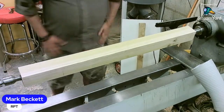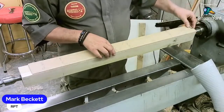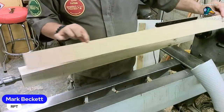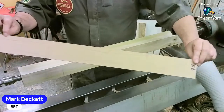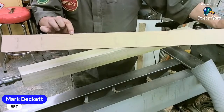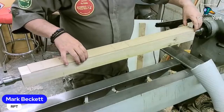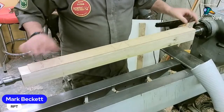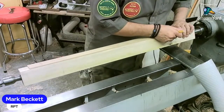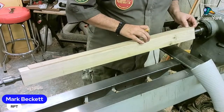Just before Wayne starts reading the names out - I don't know if you can see - it's got the pattern drawn on the board. The client gave me this story stick or storyboard to work from, so I'm just going to transpose the lines from this under the spindle and away we go. When I've done this four, it'll be 24 total.